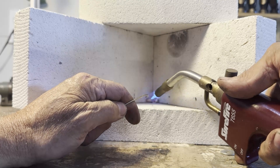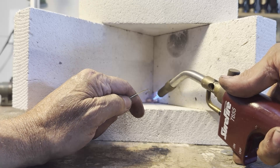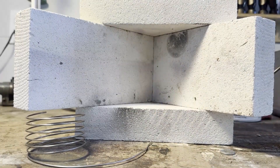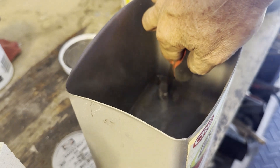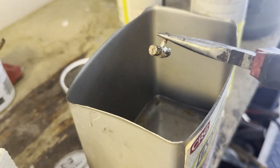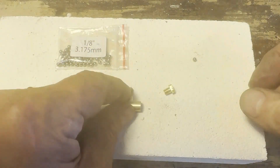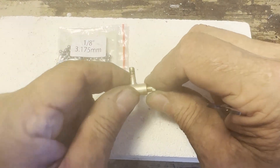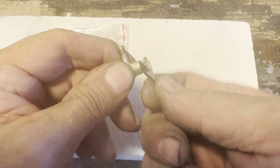Using some MAP gas and that number 56 silver solder, you've got to use fire bricks. I tried doing the first one in a vise without fire bricks and you just can't get it hot enough. Get it to just the right temperature and it'll flow, then cool it down. I had a drip of solder on the barrel of the drain cock and had to grind that off — basically I used too much solder — but I was able to use the belt sander to get it off and make it nice and pretty. You can't tell, and it was a beautiful solder job — you can see that joint looks really nice.